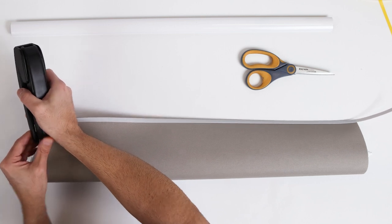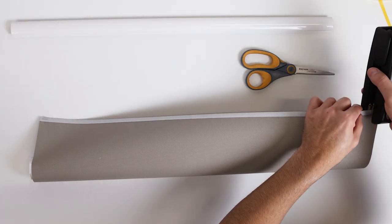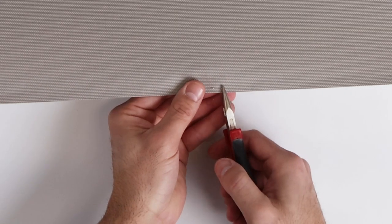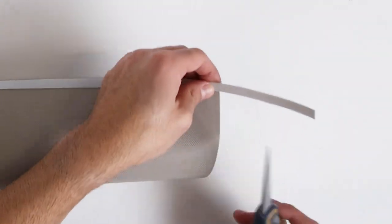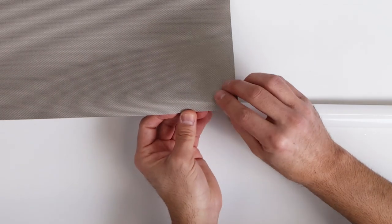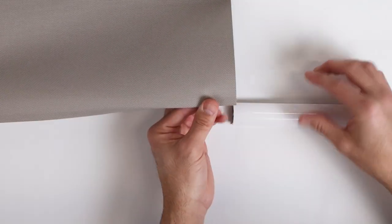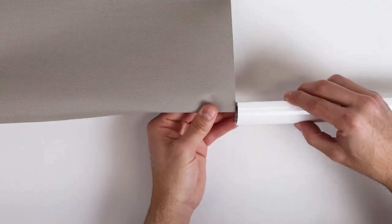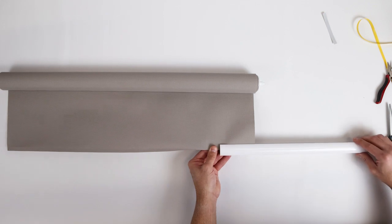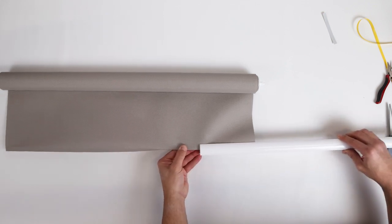Secure further in multiple places with staples. Press the staples flat. Trim the excess spline. Fold the fabric over the spline, then insert the fabric with spline into the Dual Face Bottom Rail. Avoid moving the fabric during this process — only move the bottom rail.